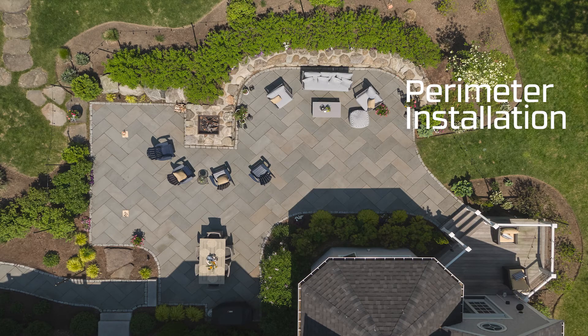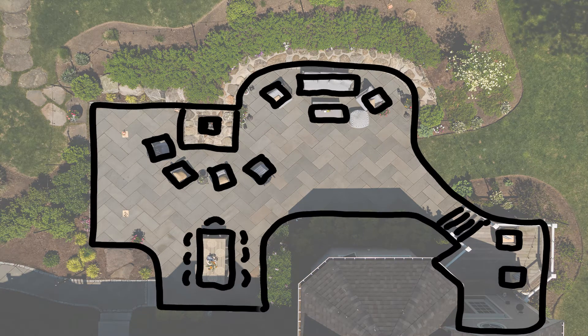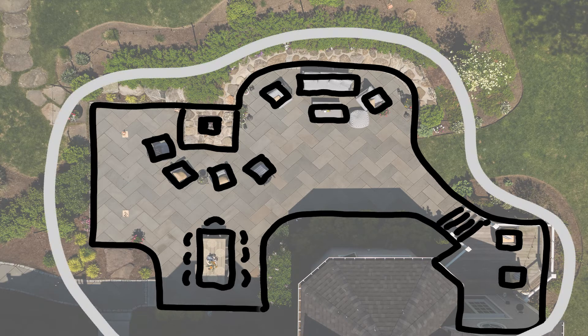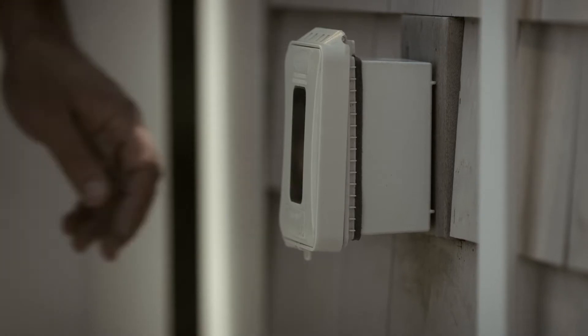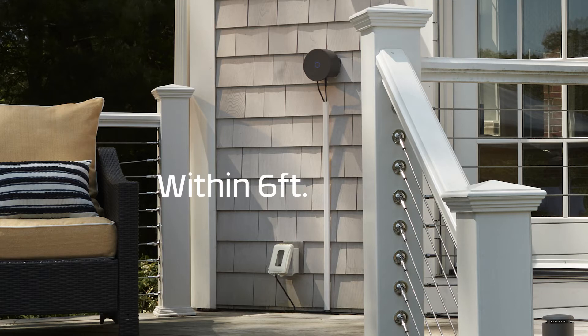You can choose to add optional hardscape bases depending on the placement of repellers in your space. Planning starts with a sketch and some simple measurements. Your installation may not look exactly like this, but the same planning and layout steps apply. You should plan to install the repellers in a perimeter around the area, so draw a line around the area representing the perimeter. Next, determine where you'll mount the hub. The hub connects to an outdoor GFCI outlet found on the exterior of most homes.